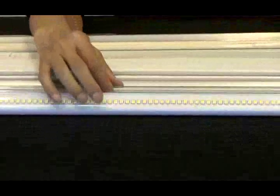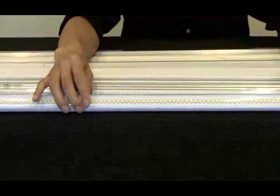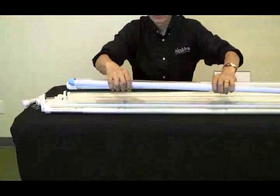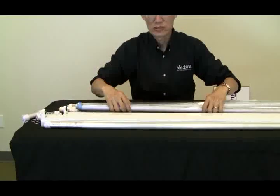And this one's actually more like a T12. If you can compare, it's almost like a T12, more like a T12. Even though it would not affect installing this tube into most of the fixtures, some of the fixtures have very tight spacing, so it will be very difficult to insert those fat T8 or oval T8 or T10 into those tight fixtures.